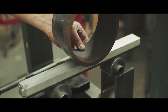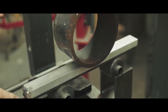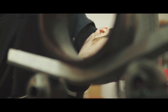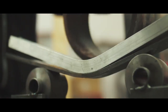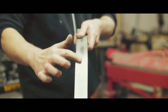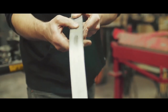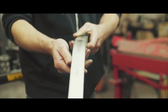So that's really the trick to this whole process, and what I'm using for that backing plate is a piece of quarter-inch cold-rolled steel. I'm just checking and making sure that it's sticking with the backing plate. As the bend is progressing you've got the wall in here thinning and the wall on the other side compressing and thickening a little bit, but if you look at the whole tube you can see it's still very square — and that's really what's important, because if you want a structural part you really have to have the same cross-section all the way through.